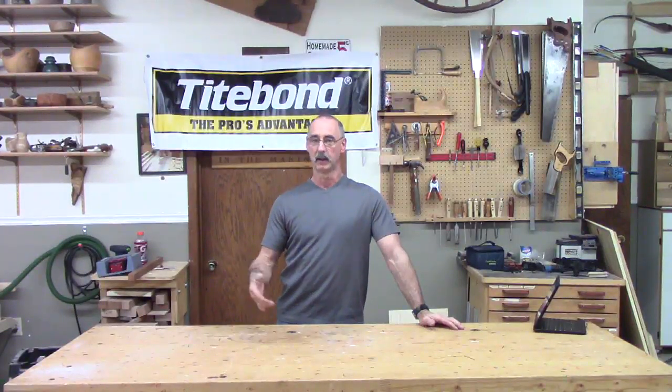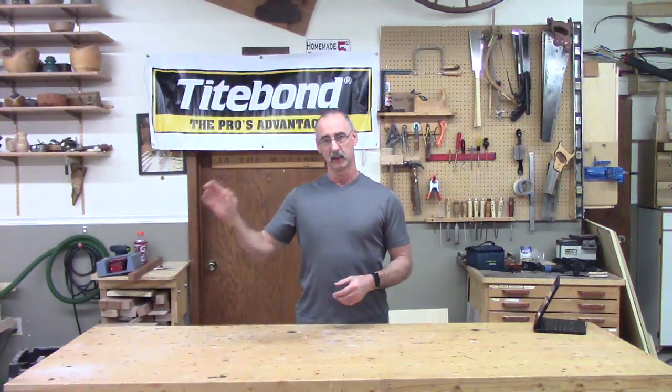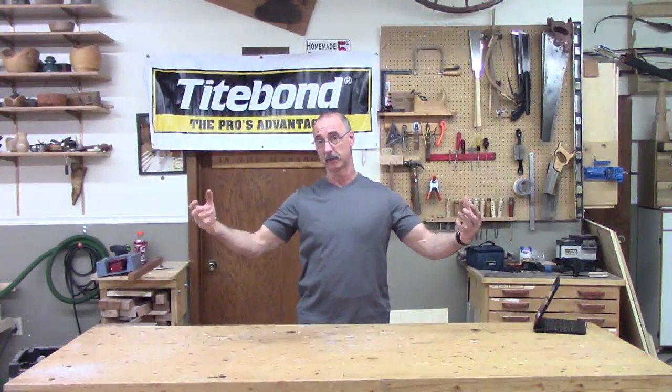It depends. One of the things would be, are you going to run items at the same time? Are you going to work in the shop with anybody else? If you are, and a table saw and jointer might be running at the same time, you've got to go to a bigger unit so that you can provide enough airflow for that. If it's a onesie-twosie basis, the thing to do is figure out CFM per machine. You can find that information online, how much CFM the unit is providing, and then are you piping it in? Because then that drops your airflow.